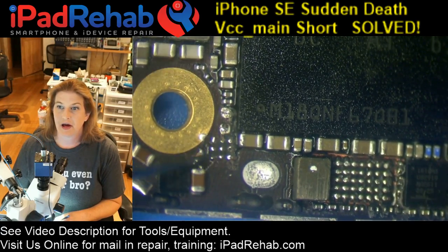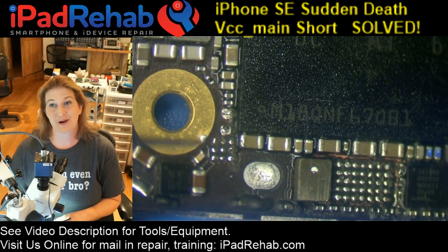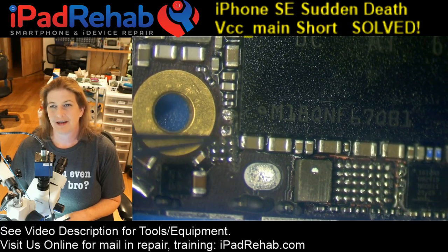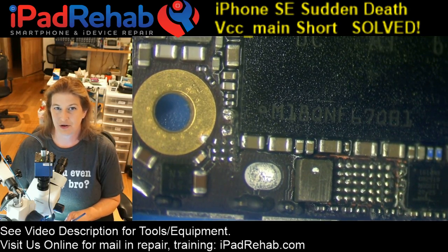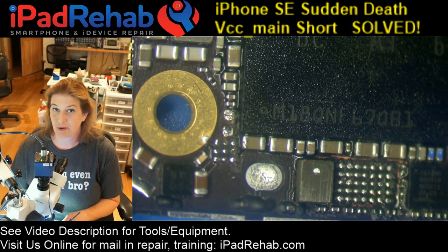So this spot is always going to get very hot. If you look on the schematic, could that be the reason why I have a short to ground? And the answer is no, because this guy has no path to ground, so it can't possibly be him. We've covered in earlier videos why this MOSFET always heats up with a VCC main short, but he can't possibly be the cause, because he can't turn into an inappropriate wire to ground.